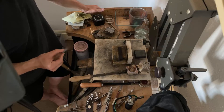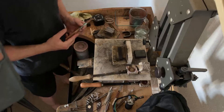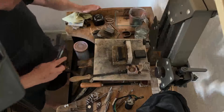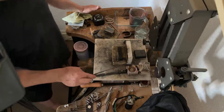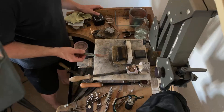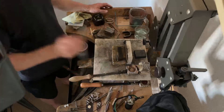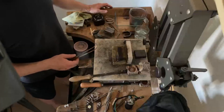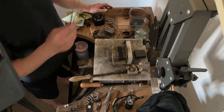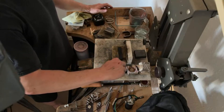With silver it can actually take on board the water, and then when you roll it, it's like wringing out a sponge. The amount of work that's gone into this at this stage, it's better to be safe than sorry — trying to rush it and then having to go all the way back to square one, melting it, pouring it, peening it and starting this process all over again. Although if problems develop at this stage, you are better off going back now to stage one rather than trying to persevere. You're just wasting time — even more time.